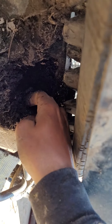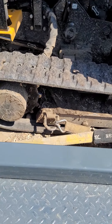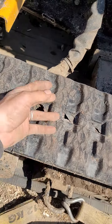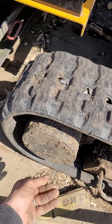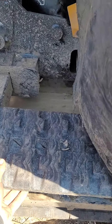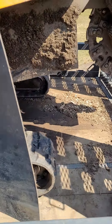You just take that out with a one-inch wrench, grease comes out, and then you shrink up the track a little bit. You put the head down, put the chip blade down, lift the track up, and you could suck it in with a ratchet strap or even hook a chain to it and pull with a tractor or any type of equipment and slowly walk it back on. Then just pump the grease back in nice and tight. I keep them with a good inch or two of play.